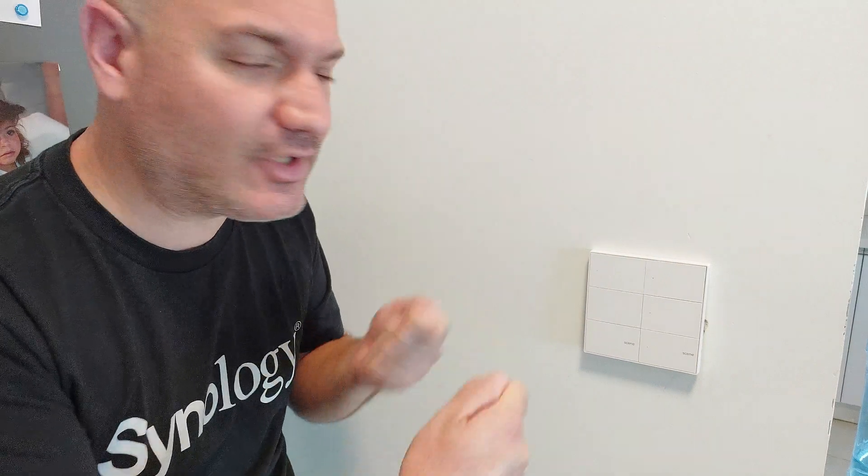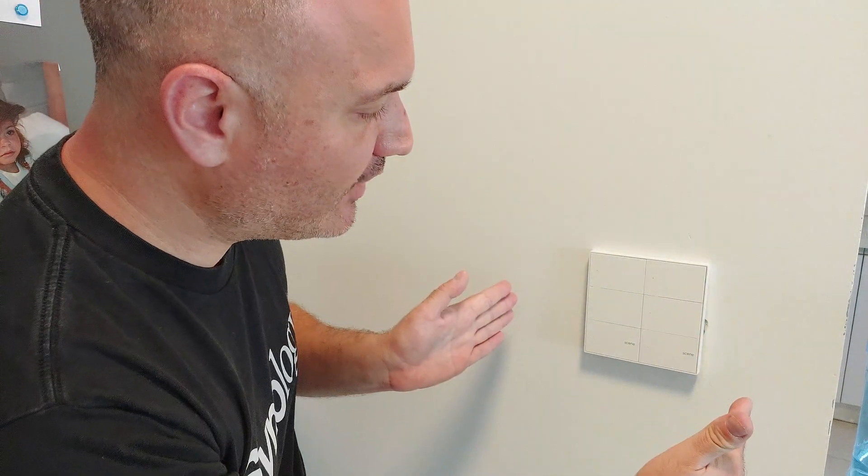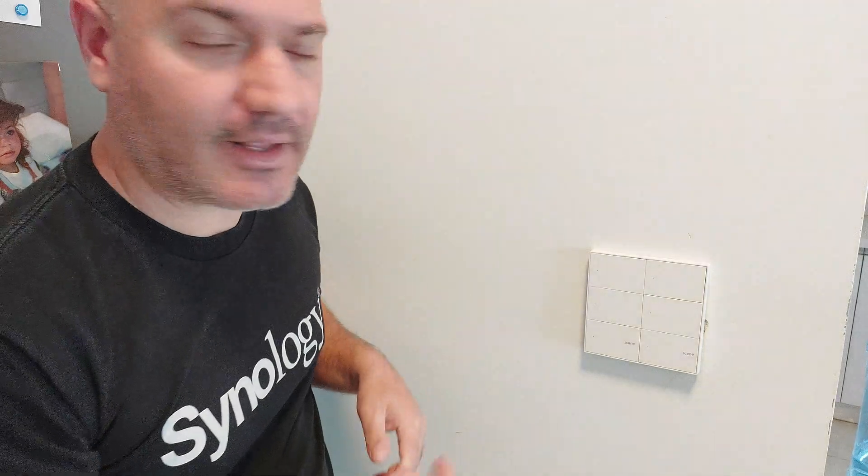I had to cut the recording because I ran into clearance issues — the back of the device wouldn't fit in my electrical box. I tried some chiseling to make more space but still have some clearance issues. I'll write the exact measurements of the back of the device in the video description so you can determine if it'll fit in your electrical box. Generally though, it looks very clean and aesthetic. The wiring couldn't be easier, and the diagram Zemismart provides in the box is very accurate: live wire into the bottom terminal, neutral to the left terminal, and fixture wires to the side terminals.